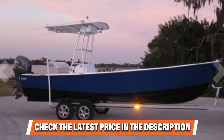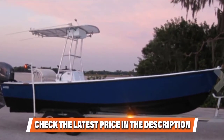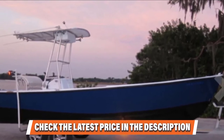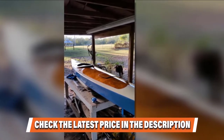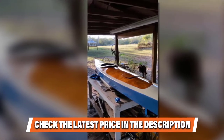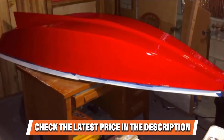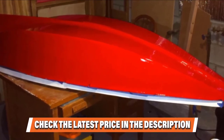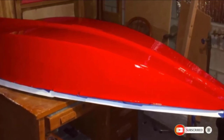Proper rolling and tipping works quite well but must be executed slowly, otherwise you will encounter runs where you don't expect them. Do not skip sanding, otherwise you could encounter flaws that will look quite visible through the paint. Be sure to follow the manufacturer's application instructions. Some lapses to be watchful of with this product are the tendency of the paint to streak, and if you want a nice smooth and even finish, several coats are needed. Check the description box for the latest price.